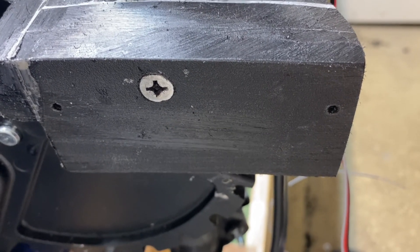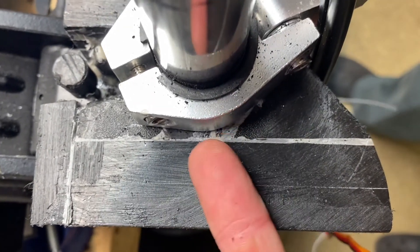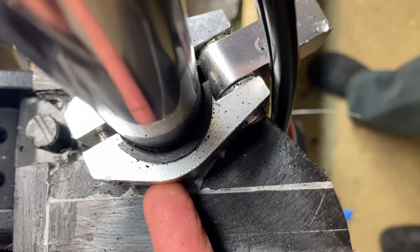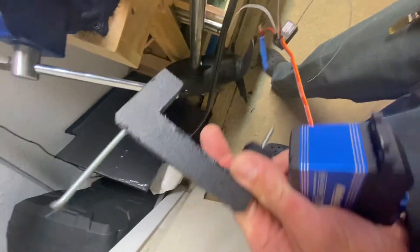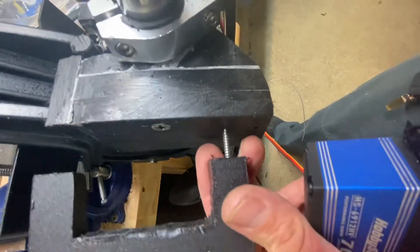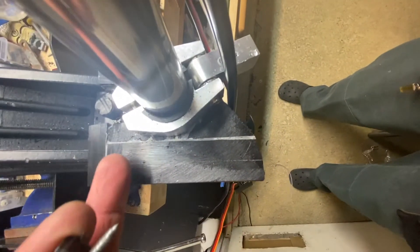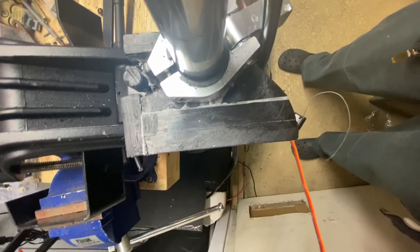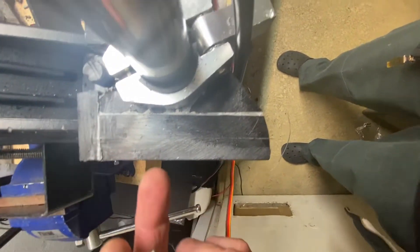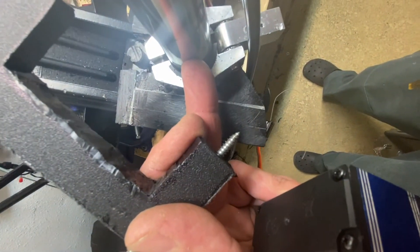Here you can see the screw that holds all the plates together — one and two screws into this collar that used to be the brake. These two screws on the servo holder go through these two holes all the way through into the back, securing it further and holding all three pieces together. This final screw holds it to the outboard motor itself.